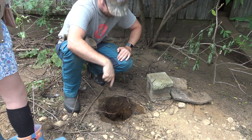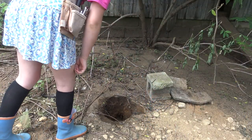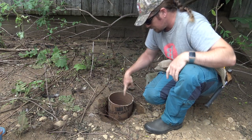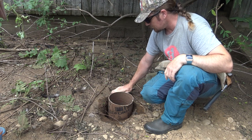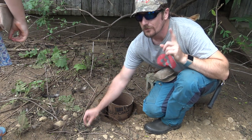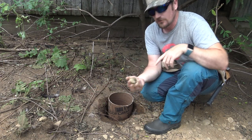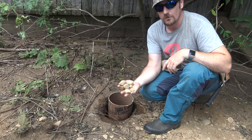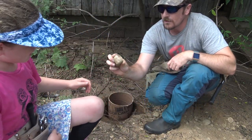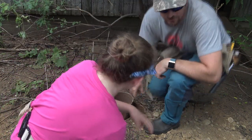It looks really deep from above, but it's always not as deep as you think based on the amount of work you did. This is a 24-inch sonatube and we're going to set that in there roughly level, just a little bit above ground — we want our cement coming up just a little bit above grade. We also want about a couple inches of gravel at the bottom, so we're just going to pick stones from the digging and drop them in there — small ones, nothing bigger than that — and those are going to go in the bottom for the post to sit on.